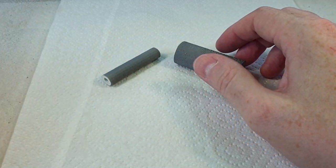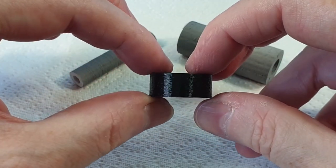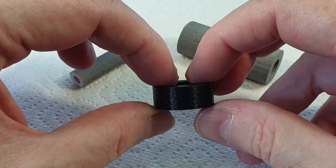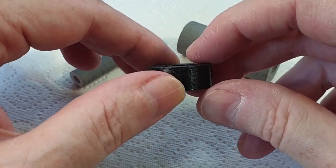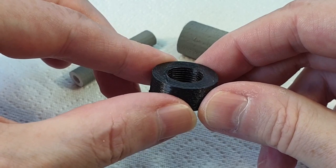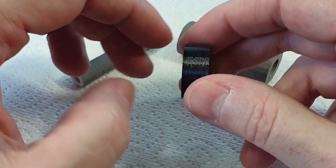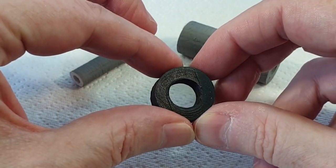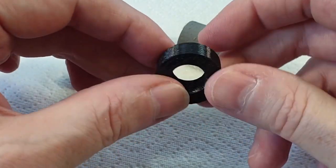And just for comparison, this is a piece I printed a while ago, and this was a test piece, actually. I was printing a suppressor for my son's airsoft rifle, and this piece, I can't remember the name of the guy, I'll have to see if I can find it, and I'll put a link in the description. But this is a test piece that the guy supplied with it, because on the inside of that, I don't know if you can see it, but there's a thread, and it's a 14 millimeter left-hand thread, and that screws onto the end of the barrel of the rifle. So the idea of this piece is you can print it, test it, see if it fits, and if it doesn't fit, you can scale it on your printer. As it turned out, this fit perfectly.